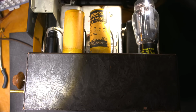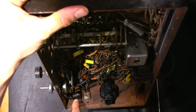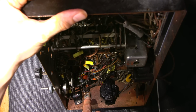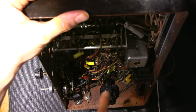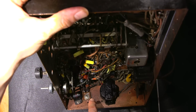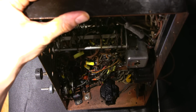Another portion of this radio receiver that has been most likely detuned over time and never retuned properly again is this 10 kilohertz audio cutoff. So there's a little filter network down here, there's a little inductor and a capacitor across it that's designed to cut off the audio after 10 kilohertz. So this is between the last audio amplifier and the grids of the 6L6s. Now, there are no instructions on how to adjust this in the alignment procedure, so that's something that was done at the factory, and I guess they just expected you to leave it alone.